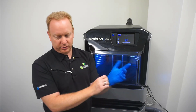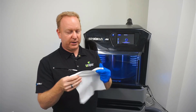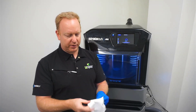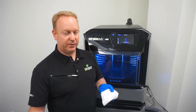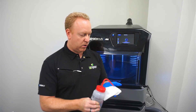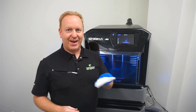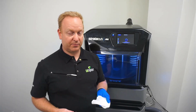Put on your gloves, and I always fold the cleaning cloth into quarters — I just find it fits better in my hand and I can get more of the alcohol in it. I want to get the cloth pretty darn wet, almost dripping wet. You want it to be all the way saturated so that you're cleaning the print heads and not just smearing around the print material that's stuck on top of them.